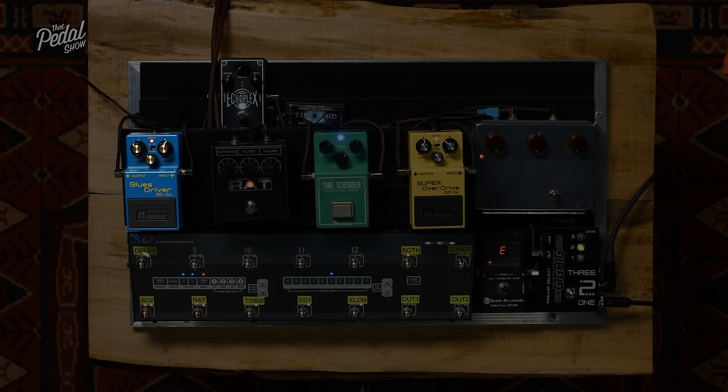Okay, so let's hear with no clipping. So what we're going to do now is take those diodes out of the signal path. Sorry, I just immediately stopped playing with the same force on the guitar because it was five times louder. Because we're no longer limiting that signal, it's basically wide open. You'll have a tone shaping filter in that feedback loop, but there are no diodes, so there's nothing to clip that signal.